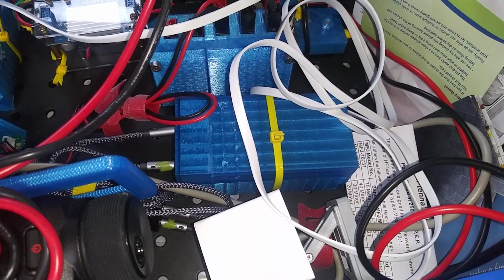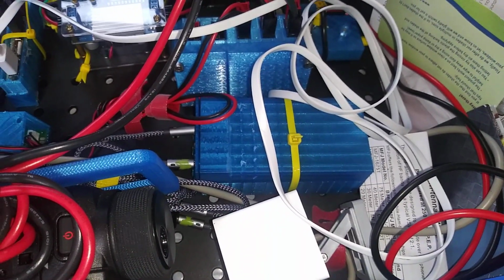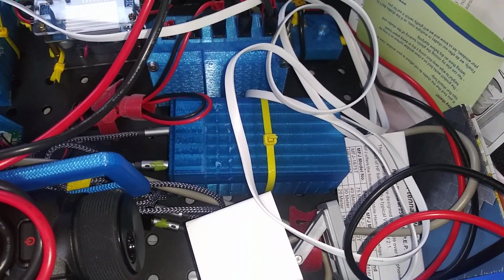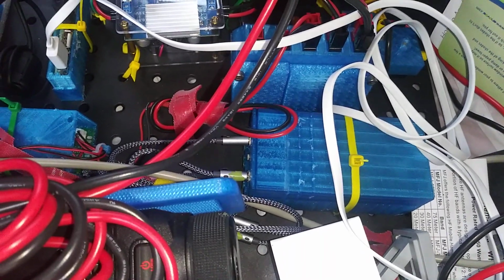I don't even know if it's really necessary, although if you buy a commercial sound interface, they sell them all on eBay, compatible with the FT891, they all seem to have those transformers as well, along with some capacitors and stuff for noise filters. But for me, the transformers seem to be enough. And so you can see microphone and speaker then go into a USB dongle, and again, trust me, it's there, you can't see it in the pile. And that's pretty much it.